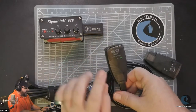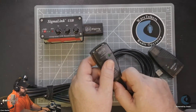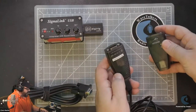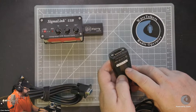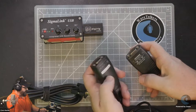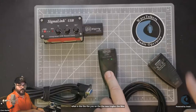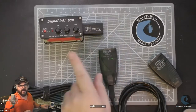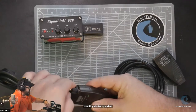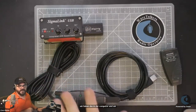To plug this into any modern computer — most of which no longer have serial ports — you'll need a USB-to-serial adapter. These excellent ones are by Tripp-Lite (formerly Keyspan). The model is the USA-19QW on the older ones, and the USA-19HS (high speed) on the new Tripp-Lite. These are really good, high-quality adapters at a reasonable price. You just take your serial cable, plug it into the adapter, plug the adapter into your computer, and the other end into your radio's built-in TNC.